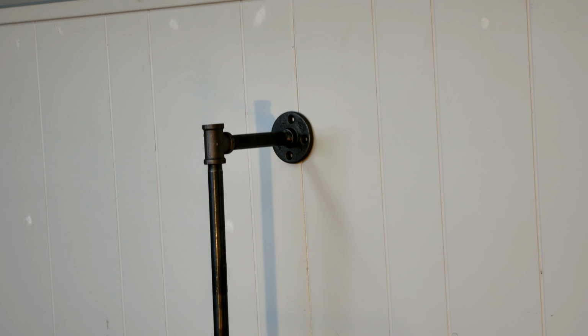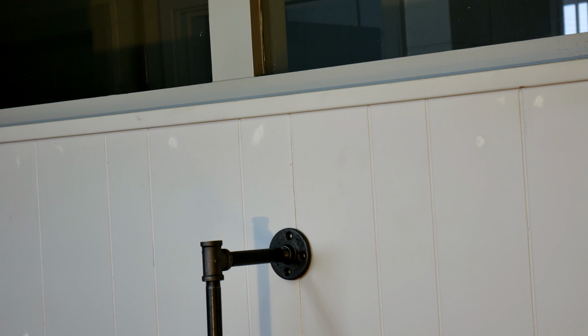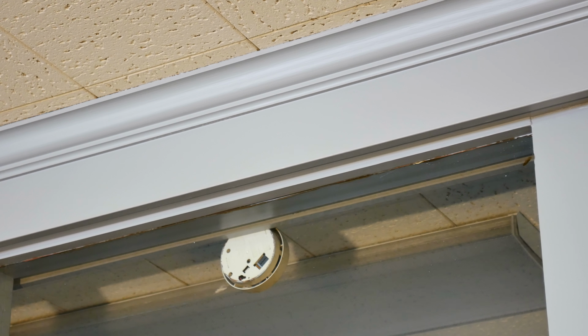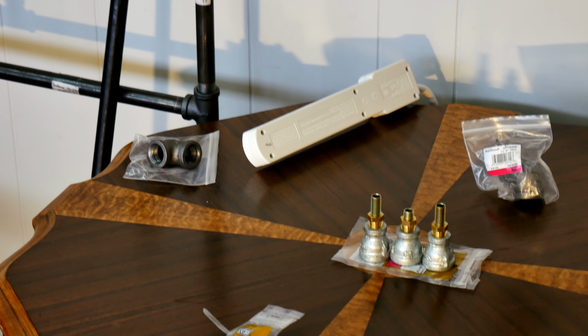and at this point, we will need to have a 10-inch with a three-way, a 24-inch running across the top, into a 90. And that 90 will be right about here, and it will run up just the same through a 24 into a 90 at the top of the molding, and then it will run across here. And right about where that fire alarm is hanging on the other side of the wall will be a three-way, which will have a 12-inch pipe off of it, going into a 45, and into these little guys right here.